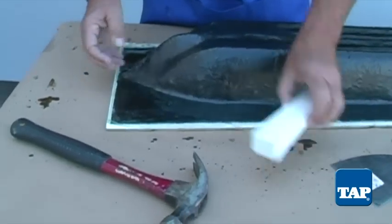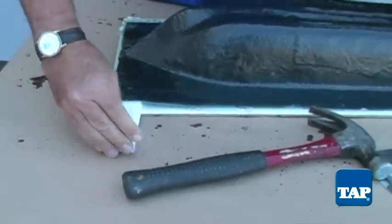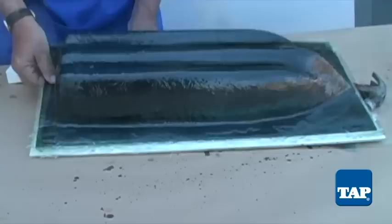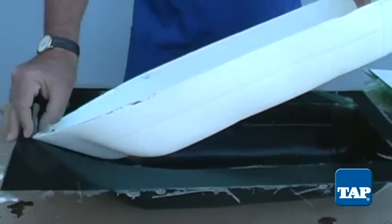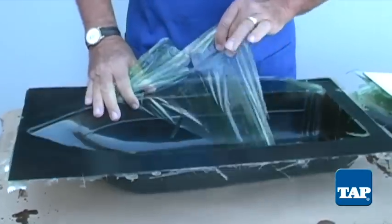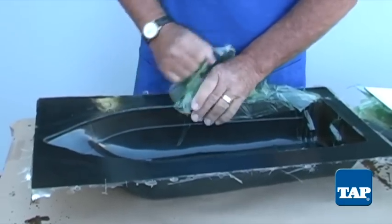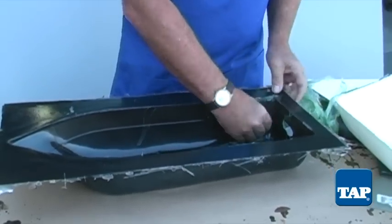Removing the mold can sometimes be a challenge. Start by breaking the seal around the edge with a putty knife or a plastic wedge. Then work your way around and loosen the whole thing. If the boat comes off the board, carefully loosen it in the mold without scratching the mold and eventually it will pop out. Because we had good thorough coverage with the PVA, the boat is coming out quite easily. The green film you see me pulling off is the dried layer of PVA which acted as a barrier between our mold and the original boat.